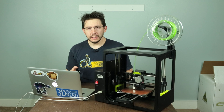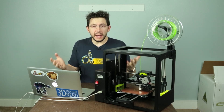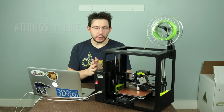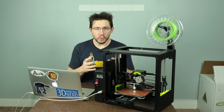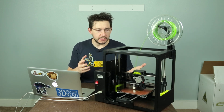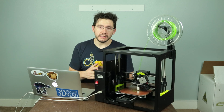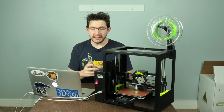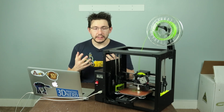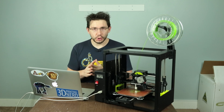Let's go over the things I like, then things I don't like, then a final thought. Things I like: this printer is built tough. The case is metal and it's held together real tight. There are 3D printed parts on this machine and they look rigid and robust. Even through the action of it rubbing the nozzle on the back of the bed — that would tear some machines apart — this just laughs at it. I really like the hot end: 0.5 millimeter nozzle going to 300 degrees Celsius — you can throw nearly any material through that thing. I really, really like the way it levels the bed and cleans the nozzle. That is genius — absolute genius.